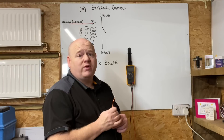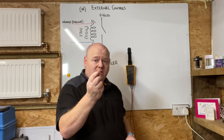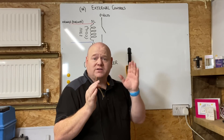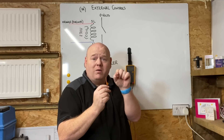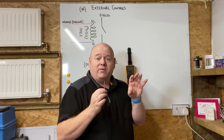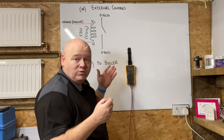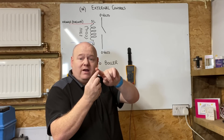What we're trying to do is keep the circuits separate. We've got two zone valves - one of them has an external pump. If the orange wires from both zone valves both went into the wiring centre like they normally do, then when either zone turned on, it would turn the external pump on. But we only want the pump to come on for its specific zone - otherwise you get back-feed. That's the reason we use a relay.